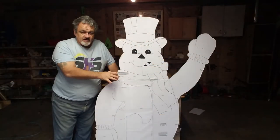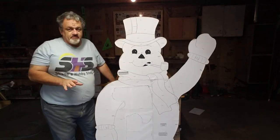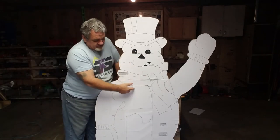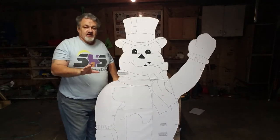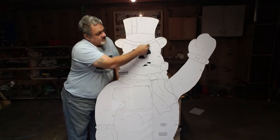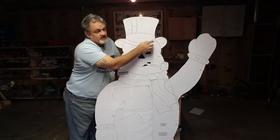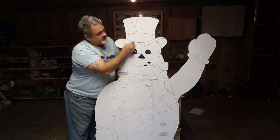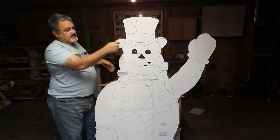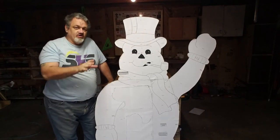We went ahead and got it glued up to the hardboard, got it cut out, and now, since this is going to be a pattern for other boards, you're going to want to know how you can locate your eyes and all of these other lines that are in here. That's pretty simple. What I'm going to do is use a small plunge router with a small bit and go ahead and cut these lines out — not all the way through. If I cut this line all the way out, the hat will fall off. So I'm just going to do dashes in here. That way, when I put this board up on top of another board, I can just put my pencil in there and draw these dashes, and then I know where to paint on the other board.